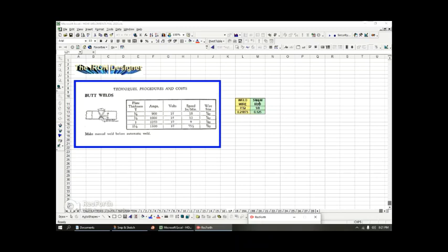So their weld wire is huge. Our welding rod is pretty thin. So when you see a table like that, don't just look at the values. Try to do interpolation of the values and bring it down to where you believe you, as the weld engineer trying to avoid weld failures, are going to be. You're going to use interpolation and some approximation and rule of thumb. Remember, rules of thumb work out really well. They get you in the ballpark.